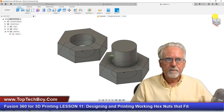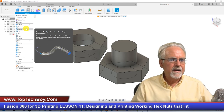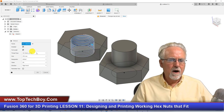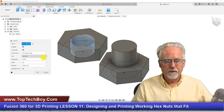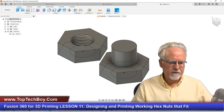Okay, now we got to put the threads on. So I come over here, I say create, and I say create threads, and then I say I want threads there. I want to make sure to model them, and I am using ISO metric profile and 25 millimeters for the radius, and that looks good. And so then I am going to say okay, and then boom, I have those threads.